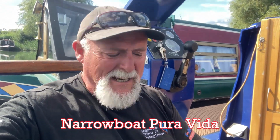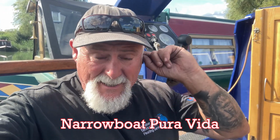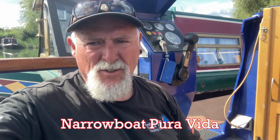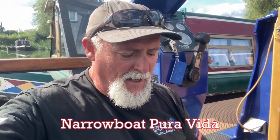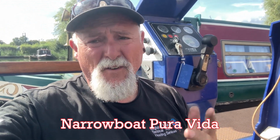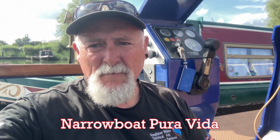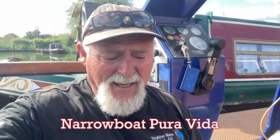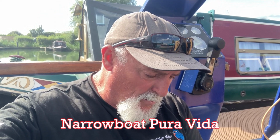That's all finished now, all tested, all working. The only thing we noticed while testing with the alternator is the engine speed needs to be up a little bit to get the voltage higher than 13.5, so that buck boost actually kicks in. So a little bit of revs to keep that. And you find that actually on a lot of alternators, people have their engines running for hours and hours on tick over. The alternator's hardly doing a damn thing. So anyway, there's enough ventilation in there for that buck boost, I'm pretty sure.